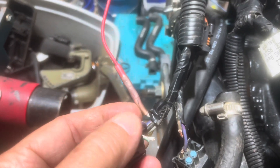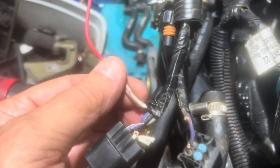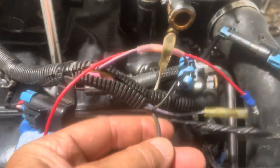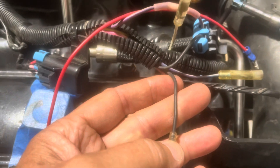I've now made up the back end of the shift kill. I've got my shift kill connector, I've got my red wire coming over here — red indicates 12 volts positive — and I've tied it into that white wire with a black stripe from the Thunderbolt 5 harness. I cut it off, bent it back out of the way, and butt spliced it with a weatherproof heat shrink connector. Up at the front, the wire ends are already done — all you have to do is connect this to your shift kill switch on your shifter mechanism.